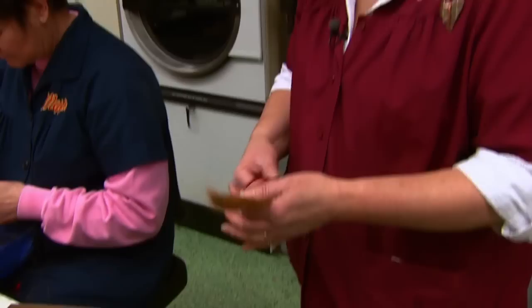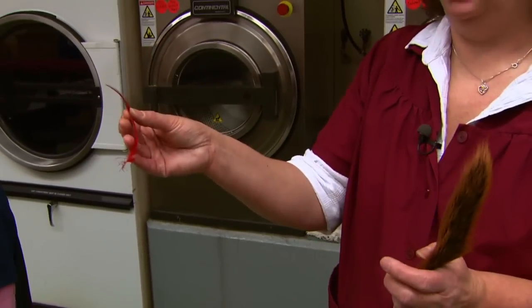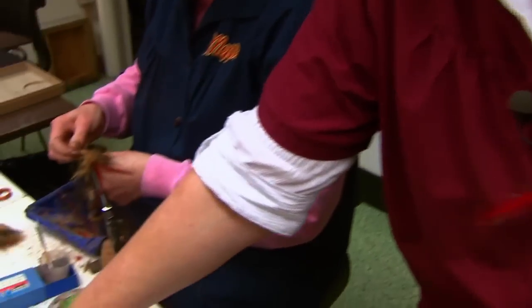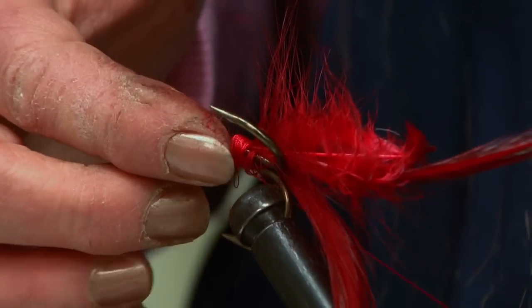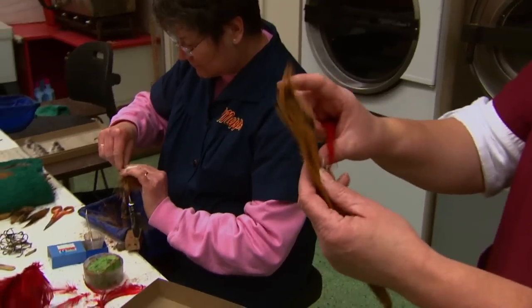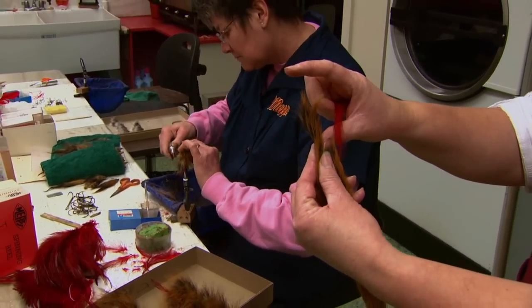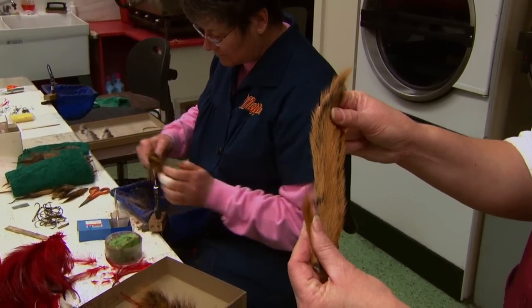Here's actually where we're going to do the tying process. We'll start out using your Squirrel Tail and your chicken feathers. These are actually white feathers off the neck of the chicken — we'll dye them that red color. The lady right here will take a couple at a time, tie them, and place them onto her hook. Once she gets the feathers tied on, we're going to take the squirrel hair, which is the tips of the tail. We break off the tip because the hair is longer there — we'll use the longer hair on the bigger size hook, and this part on the smaller size hooks.